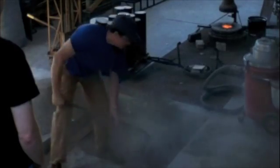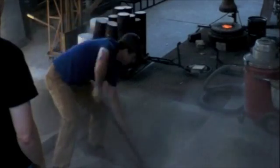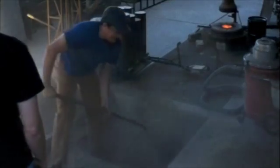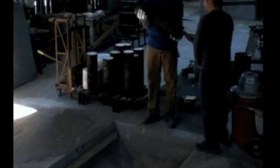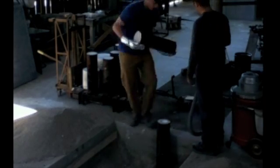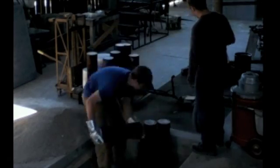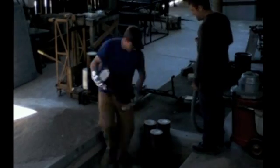We handle the investment molds carefully so as not to disrupt any details inside that might break off if bumped. We lower the investment molds into a sand pit after a brief encounter with our shop vac to remove any loose particles of sand or plaster that may have broken free. This ensures a clean casting. Sand is then packed around the molds for stability during pouring.